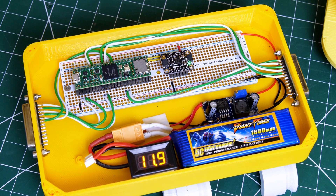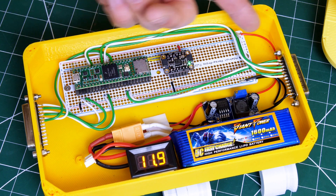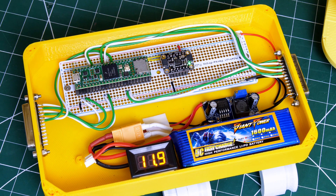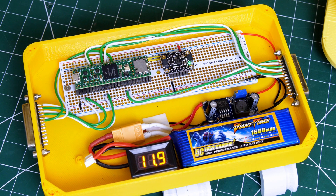It's an adjustable one set to five volts, and that's powering the Teensy and the MPU6050, and anything else we put in here with a stable five volts. That's really important so that we don't get any nasty transients from the main battery powering the motors, and all our electronics are really happy — particularly the MPU6050, which seems to get affected by a dirty power supply.